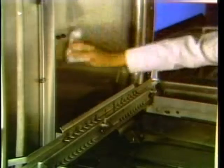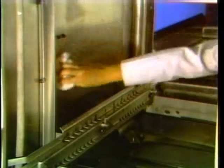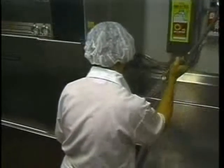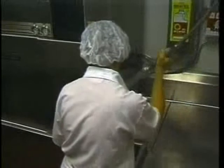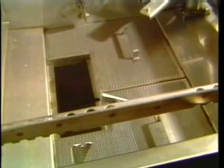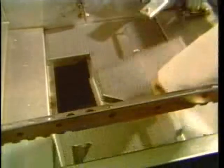Next, clean off scraps from the machine walls. With the strainer basket and strainer pan still in place, wash debris from the dish tables into the C44A. Remove the strainer basket and strainer pans. Empty them into a trash container or down the disposer, and thoroughly clean them.